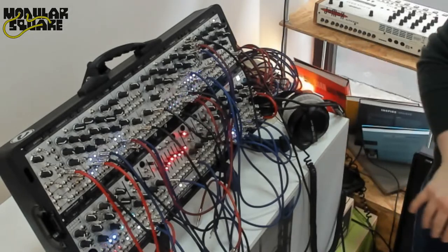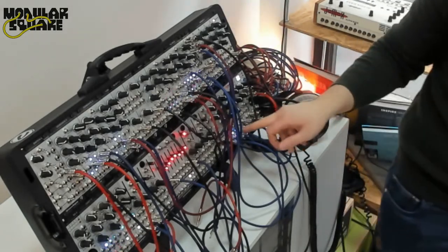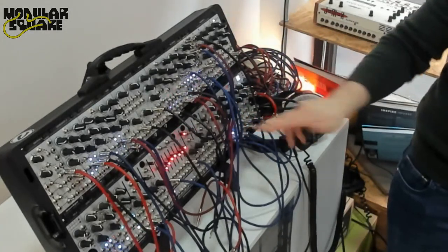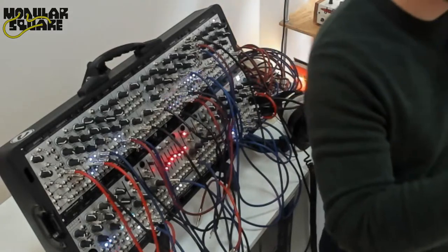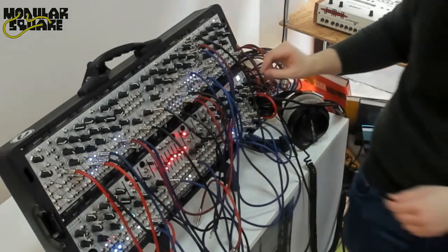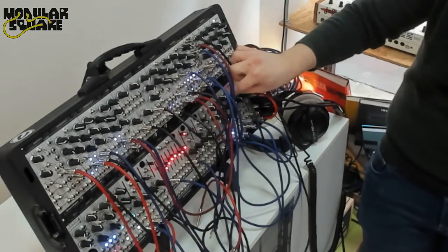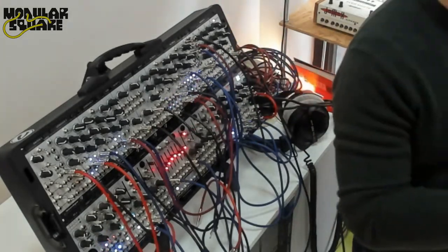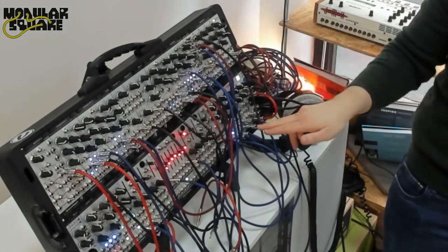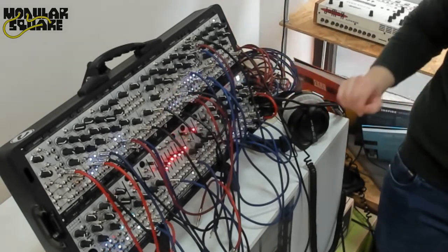I don't know if you're getting the stereo effect right here. I'm actually very far from the sweet spot, but I'm sending the negative output, as we call it, to the left channel, and the positive to the right channel, where the delayed signal is in anti-phase compared to the wet signal. And of course, all of the parameters are voltage controllable, so not just voltage controlled feedback and time control, but also variable time modulation, damping, blend, feedback, everything is voltage controllable.